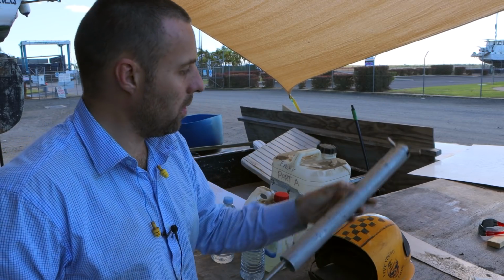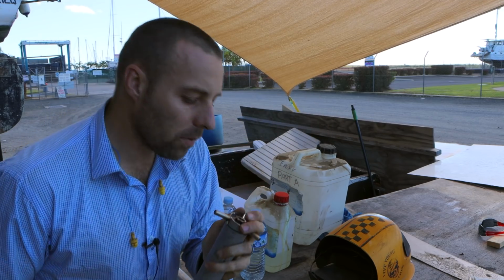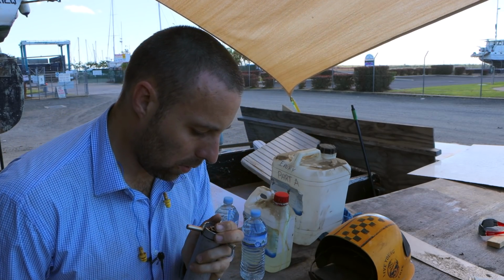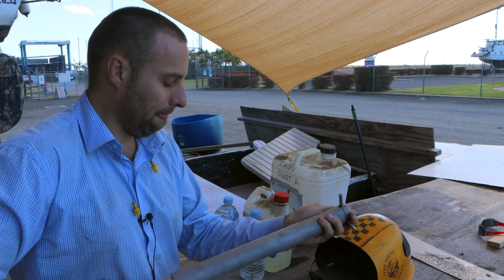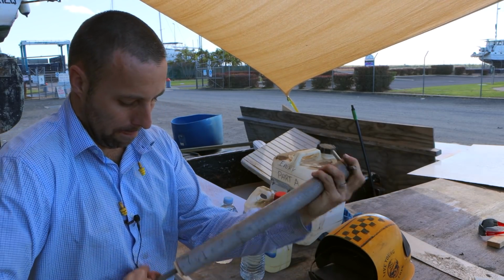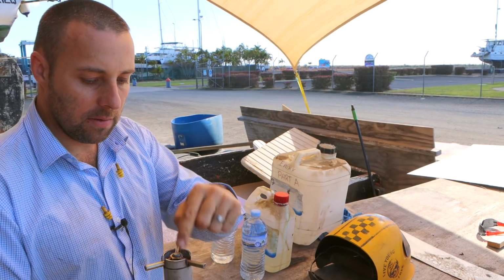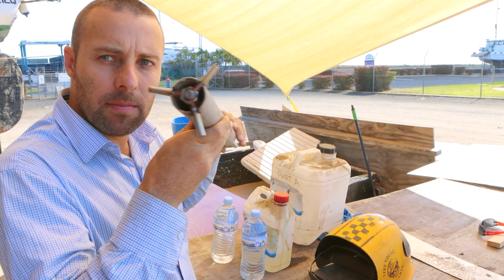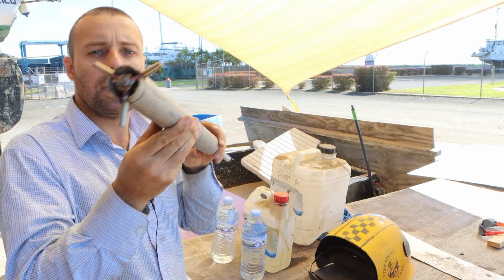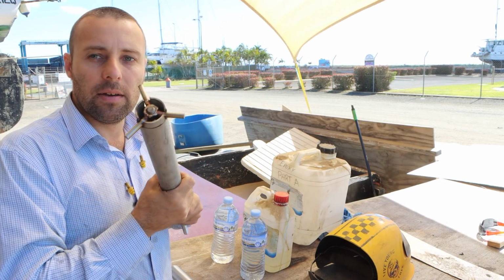Like so. Thread that into the nut, like that. There you have it. Held down, centralised at this end. So you can sort of see that centralised there. The bung thing in there holding that end centralised. We TIG that up like that. We know that we're going to be pretty much bang on. We can screw our lid down and we're good to go.